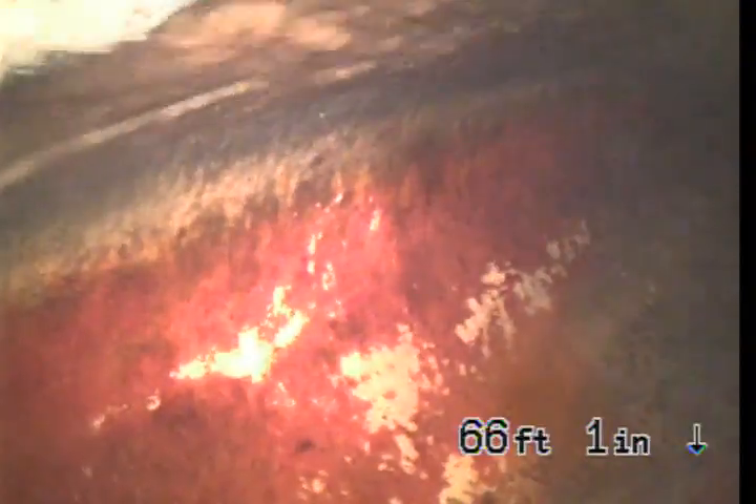We're here at Harper — we just ran the jetter and were able to remove a large portion of the roots. The water flowing by is from the city water pipe; this is the city sewer. As we pull it back, it looks like they did what's called a top hat, where they epoxy-lined a few inches into your saddle. This is a saddle where one pipe connects to another. Usually when you put in a saddle, you epoxy-line all the way to it — otherwise you still have issues in the middle.